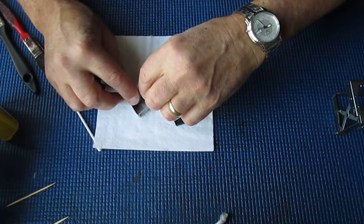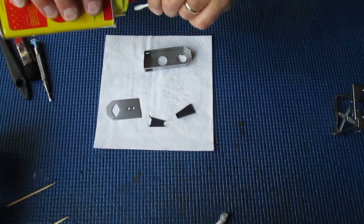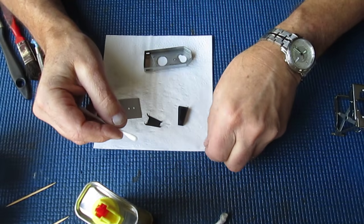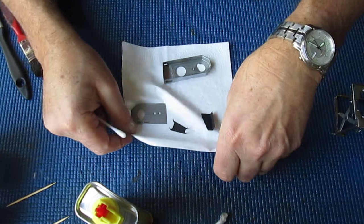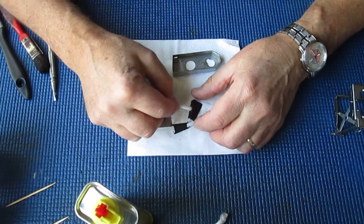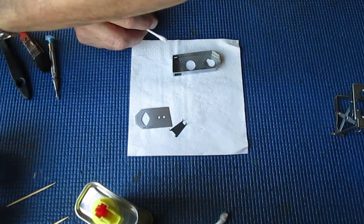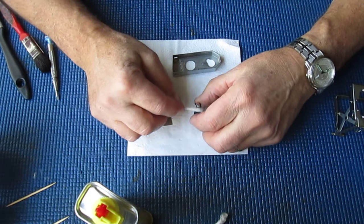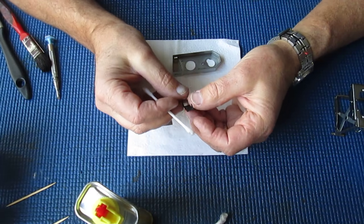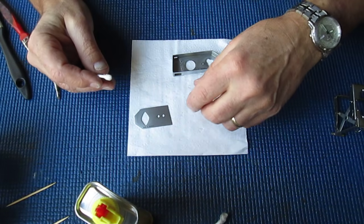The top. Alright, what have we got here? There's a few little bits and pieces. So this is just the cover for the viewfinder, and I'll need to move this over a bit. All I'm doing there is just making sure I lift off any dust, because I don't want it to fall back down onto the viewfinder lenses later. That's that little spring section that holds the front and rear lens of the viewfinder in place, and that looks okay. Just making sure that's nice and clean.